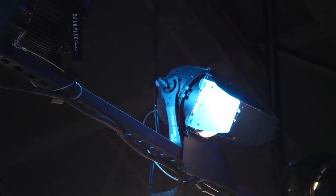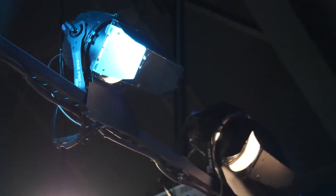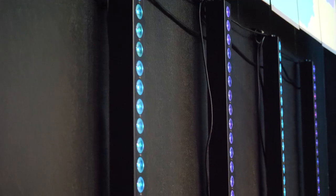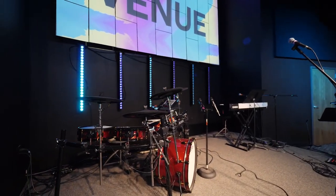This is just a limitation of the LED drivers, but for $100 a light they're the most economical solution and they're rugged — they won't break when balls hit them from nine square, and they should last forever. Looking back, I wish we had looked into spatial pendants from Springtree, but I've heard mixed reviews. For stage lighting we're using four Chauvet SlimPAR VW pars with barn doors for our small stage — it's perfect. We also have a bunch of LED pars and bars to add visual interest to the background and audience wash, but no hazes or movers in here for now.